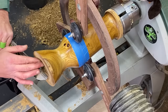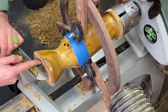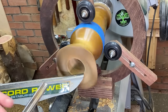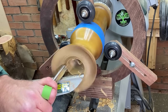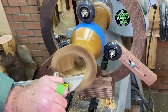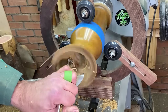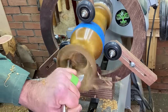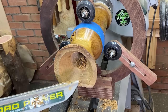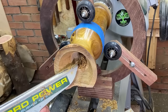We're all ready to start creating the opening in on this. I'm going to follow this curve to the neck and then blend it into the hole we've made, so it's kind of seamless. I'm going to do this very carefully, very slowly. It's looking good. Now I'm just going to angle this rest more in, make sure it doesn't catch, just so I can keep the tool closer to the wall to help cut down vibrations.